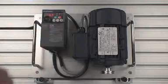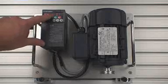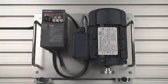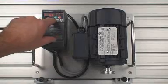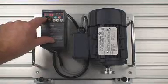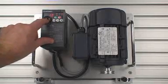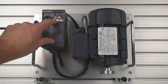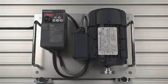You may have noticed the audible noise of the motor is quite loud. Since I'd like my machine to run around 30 hertz or 900 RPM, I'll change the speed to 30. The noise being generated is mainly caused by the pulse width modulation frequency being used by the drive. The default setting is one on a scale of 0 to 15 — 14.5 kilohertz is the max setting and the min is 0.7 kilohertz. I've changed the setting to 10.